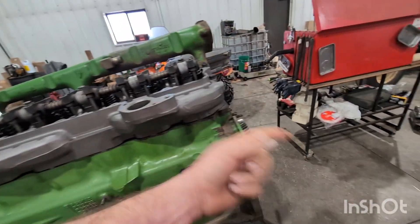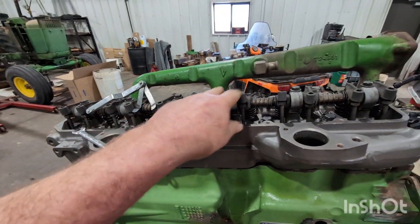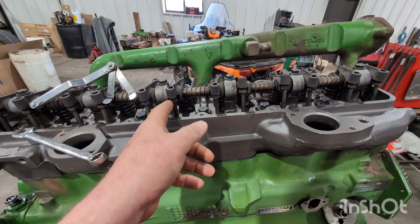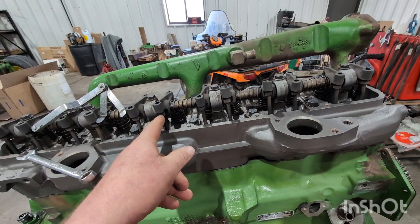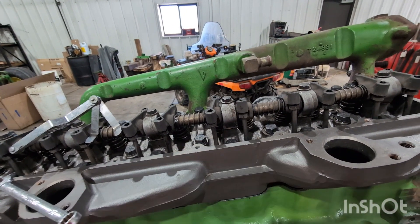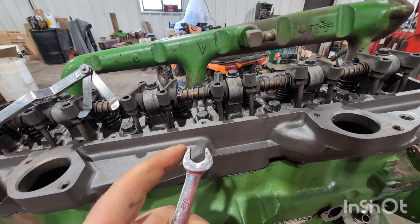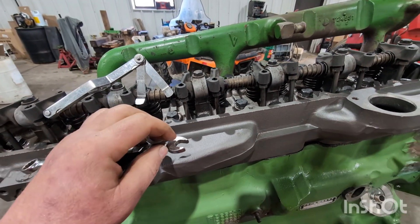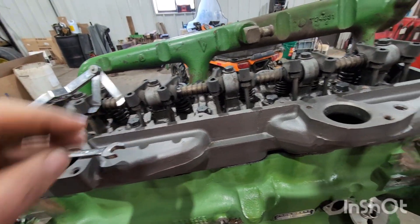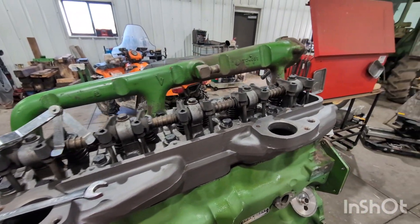Then roll it to number six and do the two and two that you missed. Also, you've got an adjuster bolt with no jam nut — these little suckers just turn very hard inside. That's where Snap-on and a lot of companies have the flank drive — you need a good half-inch wrench, not some old worn-out spread-out thing. But other than that, pretty normal.